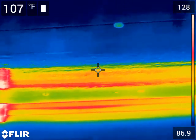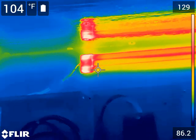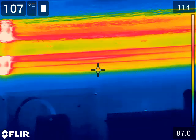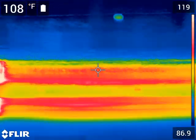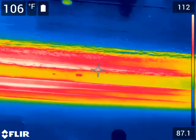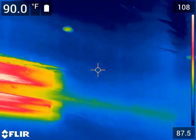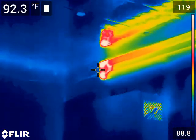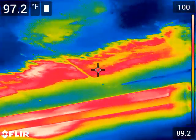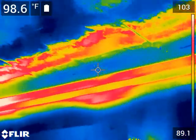Right at the top, that's a shiny metal surface. The bottom is the light fixture itself. The top looks like a second light on top of it, but it's not — it's actually reflecting off this foam insulation that has an aluminum face to it. That's the reason you can't get an accurate temperature reading off bright shiny metal. That light is reflecting here — this is the light, and this is the reflection.